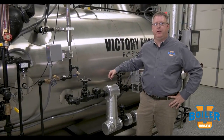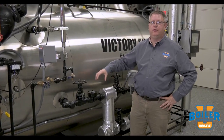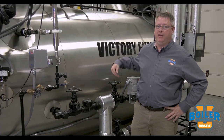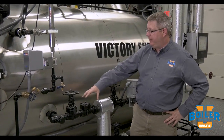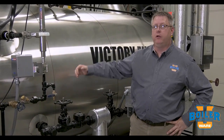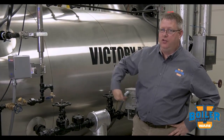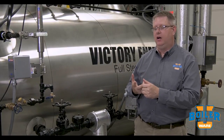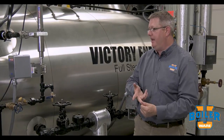This week's boiler tip, we're going to talk about check valves. Check valves are an important part of our feed water system. Basically, our check valve prevents the high pressure water in the boiler from backing into our feed system when the pump shuts off or if we have low makeup demand.